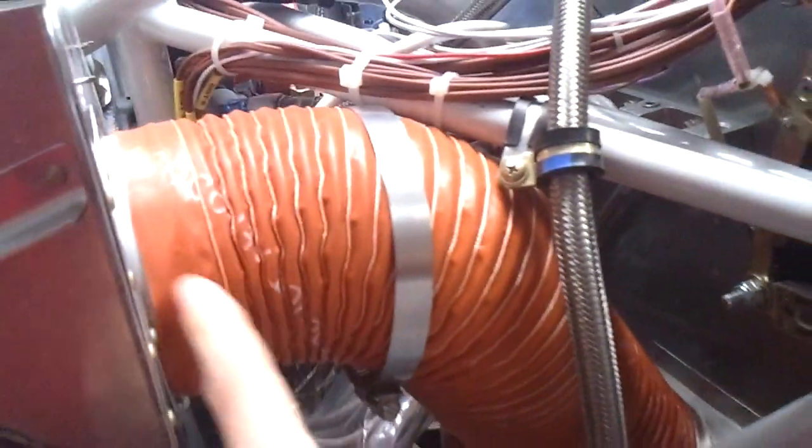And the oil system — mounted the oil cooler; just six bolts hold that on, and then you attach the lines to either side, and the oil circulates through there to cool it off. And this big scat tube here just channels a lot of air through there to cool it. And we attached this breather tube for the oil — hooks into the oil system — and it's just a big pipe right here that runs down, and here it pops out, just like that.